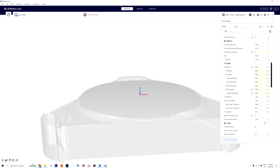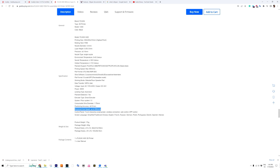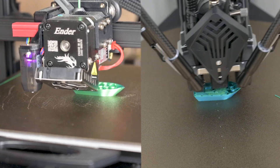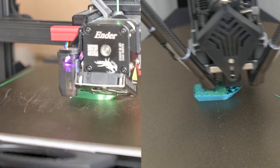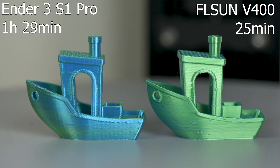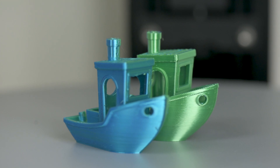To simplify the speed difference, I compared the FLSUN V400 to the Ender 3 S1 Pro. The Ender lists a maximum speed of 160 mm/s, while the FLSUN lists movement speed up to 500 mm/s and printing speed up to 400 mm/s. I printed both from the same roll of PLA — you can see the head movement speed is dramatically different. I could have slowed down the FLSUN because the Benchy came out slightly worse quality than the Ender 3 S1's, but adjusting settings and slowing it down a bit to around 30 minutes would produce a much better result.